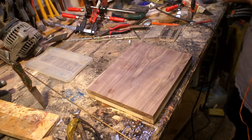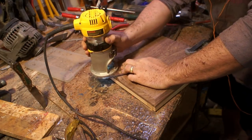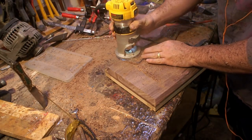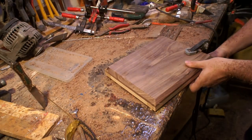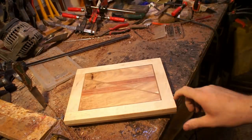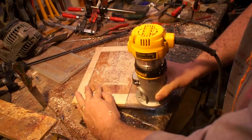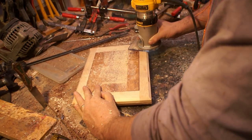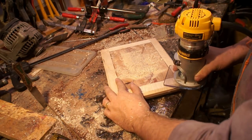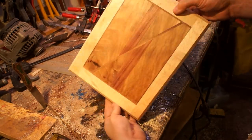To help with that feel in the hand I'm going to route all of the edges over. I'm just doing a 45-degree chamfer along the bottom — I always like doing this when something is going to be sitting against a surface because it makes it look like it's floating a little bit, giving it a sense of depth when it's on the counter. For the top I'm coming in with a roundover bit and not doing it as aggressively as the bottom. Another cool thing about using a roundover bit on curly maple is it really exposes the depth of that curl.